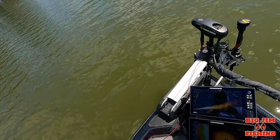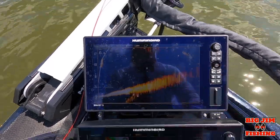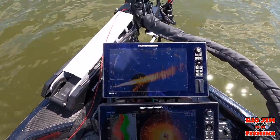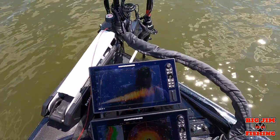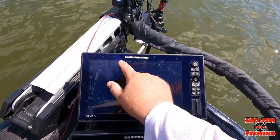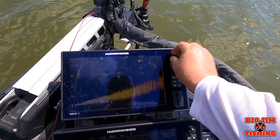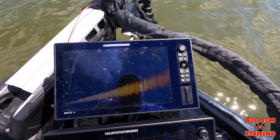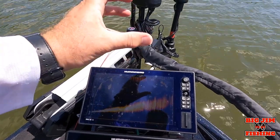One last thing I'm going to show you today is out here on the water: when you're in shallow water using your Mega Live, you can see I'm in 6.4 feet of water and you get this noise at the top. I had my range set for when we were fishing deeper water, so I'm going to go to my range, forward range, and dial it back to 80 feet. You can still see some noise, so I'm going to pull the trolling motor up and move it a click.